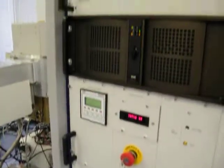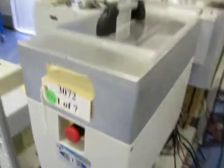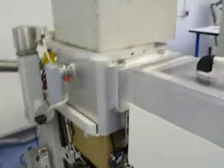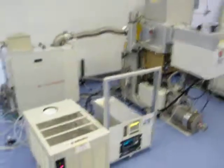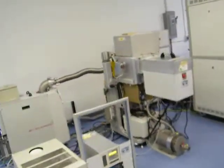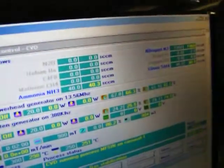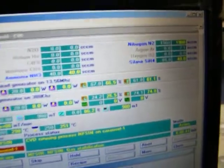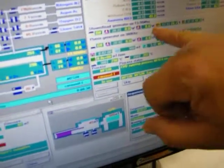The software version is Windows 2000. It's turned on the gas settings: nitrogen, silane, and ammonia. This is actually a silicon nitride recipe. I am only flowing nitrogen for all three of these — for testing purposes. Set point 40, it is 40. Set point 1960, it is 1960. So it's waiting for gas stabilization, and here it's telling you how much time is left on this step.